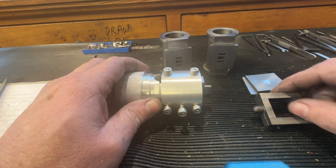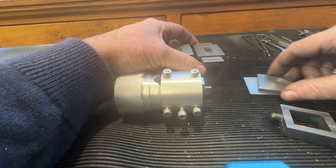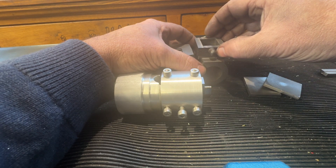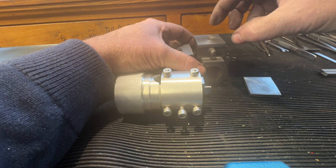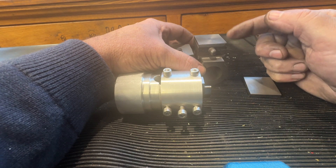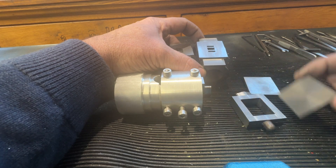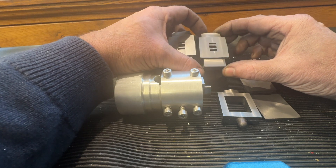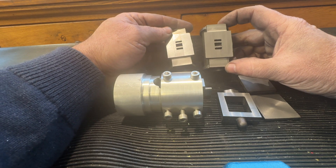Enjoy the video. I haven't shown any of the drilling of these holes here. What I tend to do is put them on and superglue them, and then I would drill the holes to the tapping size, and then open these holes out to the 7BA clear. So it's my method and it seems to work okay. Enjoy the video, and don't forget to like and subscribe. Thanks very much.